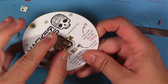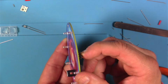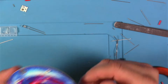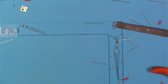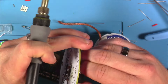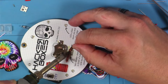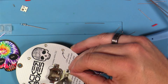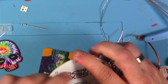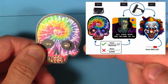Here's the first power-on test of the Galactic Badge, and as you can see, it turned on and everything looked pretty good. Not long after this is when I realized I had used the wrong connector — I was going to grab an SAO from last year's box and plug that in and realize the mistake. So then I used some flux and some solder braid — and some cursing — and got that connector out. I used a little more braid to clean things up, then I soldered in the right female connector, did a bit of cleanup, and did a basic test to make sure it still worked.